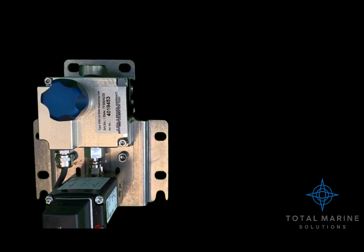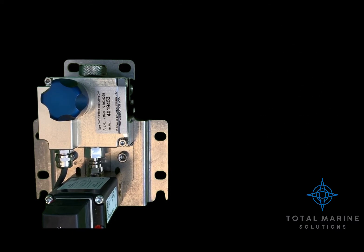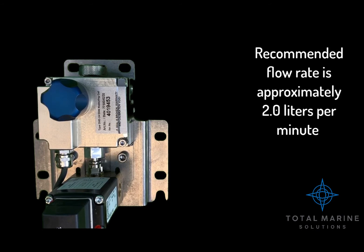If the installation has a clean water feed, the flow rate should be checked on both the clean water supply and the sample supply. If the clean water supply is obtained from a high source, the flow rate will be higher from that point than the sample point. Measure that the amount of water flowing through the instrument is only 2 liters per minute.